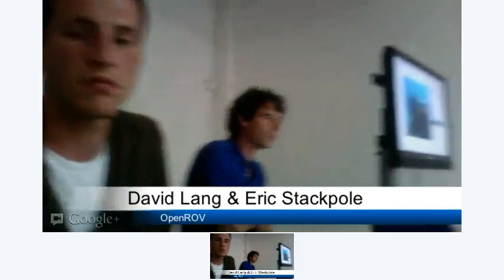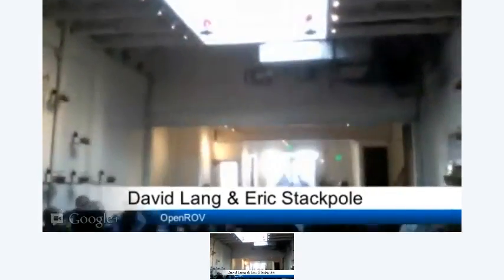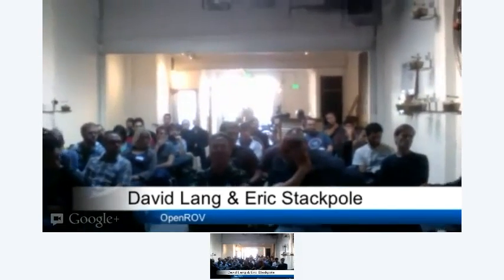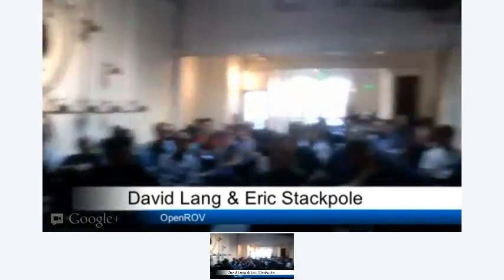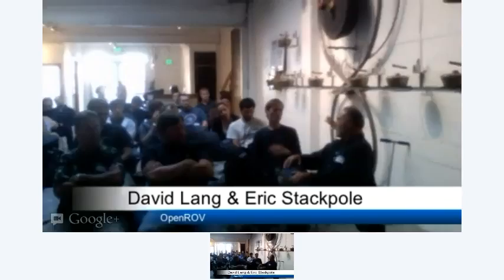And Jim's been spending a lot of time thinking about this. I don't know if you have anything you want to chime in. So part of it is to get the precise power measurement, and that also depends on what you're doing. If you take it down to a location and you stay there for a while and take pictures, you're not using all the power. There's a couple of technologies. There's Power over Ethernet, where typically you can get 18 watts, 30 watts if you push it, and that's using 50 volts. The problem there is that some of them are not four pair, you get about two pair. So it's a little thicker, although I think for moderate depths, that might be okay.